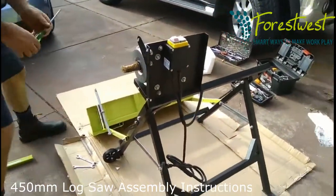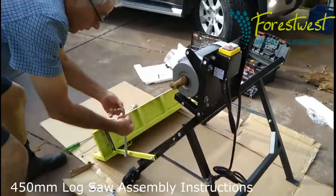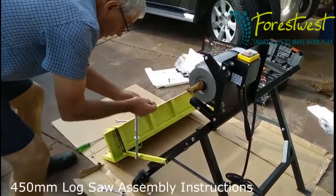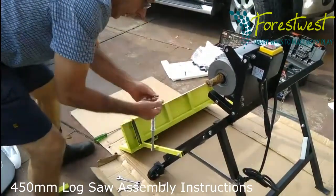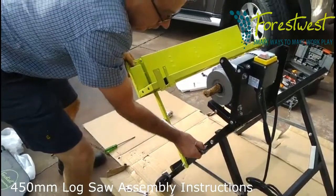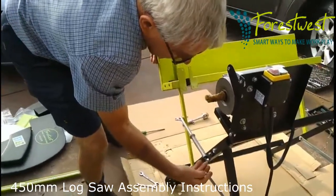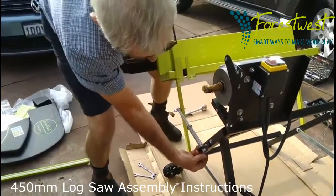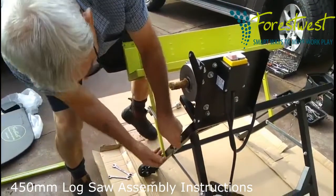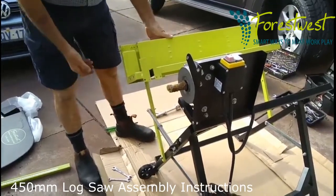To put the spring into the glide tube, release the bolt at the end here, slide off one of the washers, put the spring back on, then the washer, and put this back in under this edge. It's a matter of lifting this, putting it through the hole, dropping this into the hole that remains, and putting the nut back onto the bolt. Then that needs to be tightened — that will hold this in position and also spring back. You'll notice that it springs back easily because we took care earlier to allow that to happen.